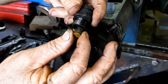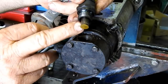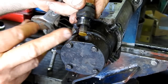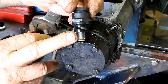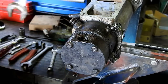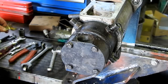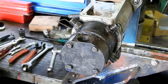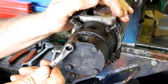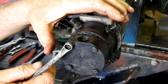And there's a little brass strainer. That's what I was trying to get to in through here. If all of a sudden you have no fuel, then you've got a bit of a dose of rubbish through. Certainly worth a look at this little screen. We will visit that later. And on the end of the pump here, take note where this screw is here.